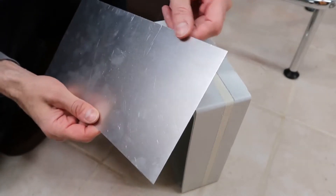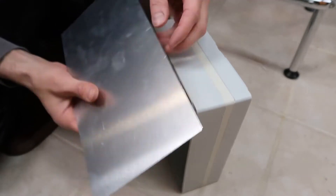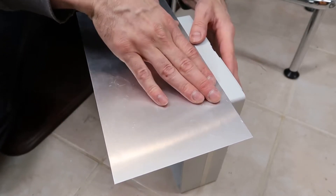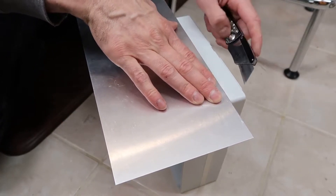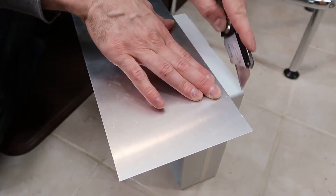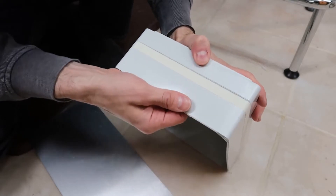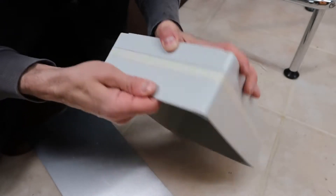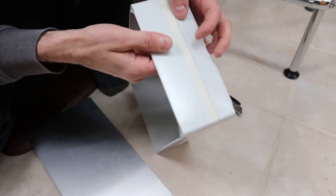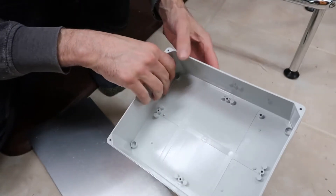Cutting through this case is a little easier than I anticipated. I have a little straight edge here, and when they shear this to cut it there's a little lip on the bottom edge. So I slide it until it hangs on the tape that I put down, take my razor blade, and just score it a whole bunch of times - just keep scoring and scoring and scoring. Eventually you have a nice line there, and if you bend it you can see it's close to breaking. It only challenges the corners; I might just use a little bit of a handsaw to get through those, but it looks like it might just snap off pretty soon.